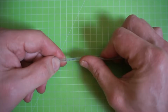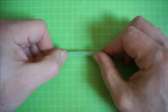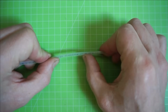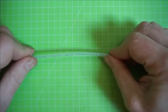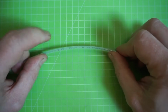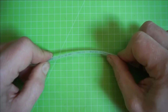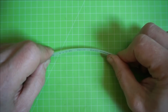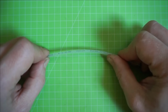So as I was mentioning, the lines I used are SKF high pressure lines with 4mm diameter. They're out of PA12 and have a bursting pressure of, wouldn't you believe it, 21 megapascals. That's 210 bars. Now the pressure relief valve on our pump is calibrated to 30 bar in my case, so that's plenty strong lines for our purpose. I wouldn't dare to use pneumatic line instead, because I think we quite regularly reach that 30 bars, and I think pneumatic line wouldn't be able to cope with that. So that's why I use high pressure line here.